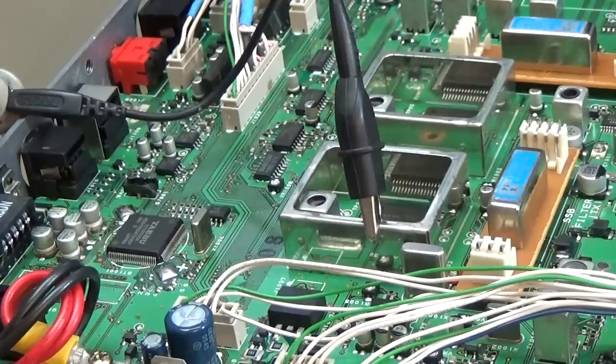to exchange the information, because your volume control is not simply a pure analog volume control as you know it. It is more an analog information which is taken from somewhere and then put to an analog digital converter, and this information is then going to the main processor, and the main processor will tell a digital analog converter what the setting for your volume should be. And that is how it works.